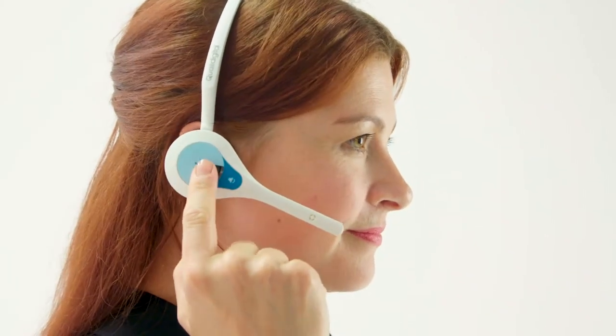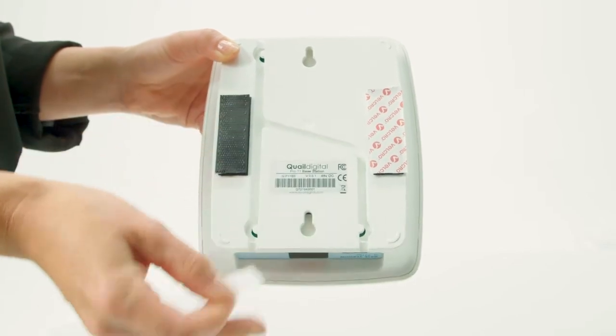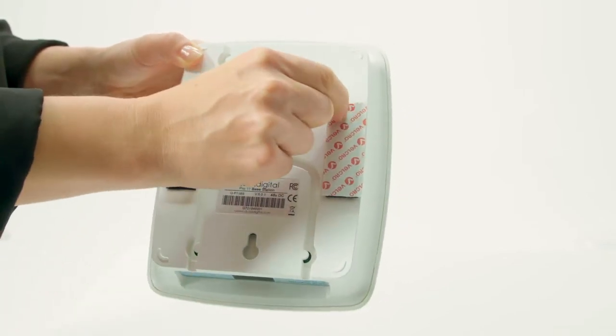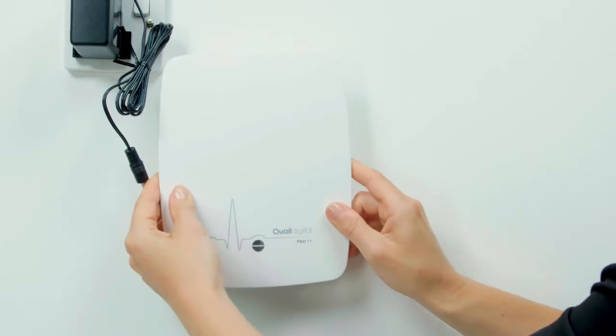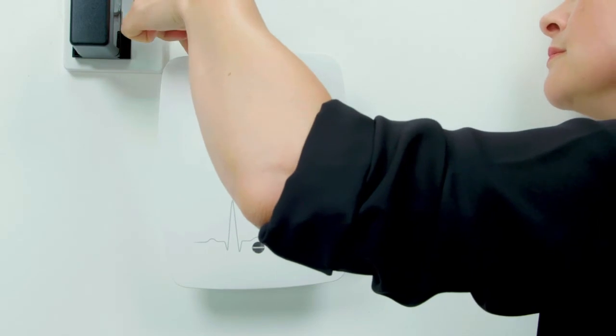Take one headset, put it on your head, and press the talk button. The blue light will remain on. When you speak, you will hear your voice in your ear. Walk around the whole area you want to cover and make sure you can hear yourself. If you can, then the base station is giving you full coverage and you can fix it to the wall in that location. To attach the base station, remove the adhesive tape on the back and fix it to the wall, always this way up. Use a cable tie to tidy the power supply cable.